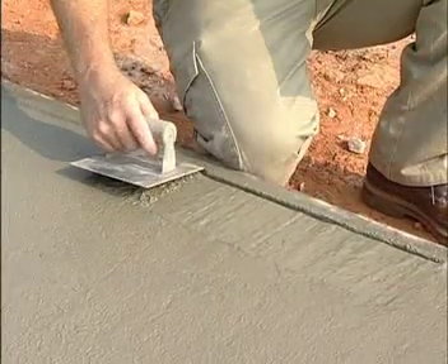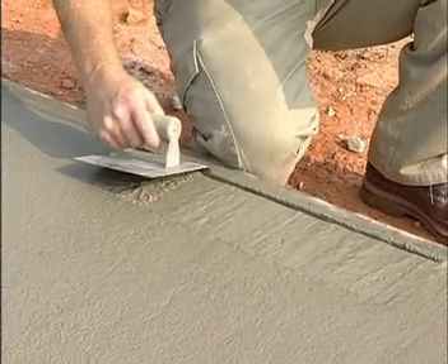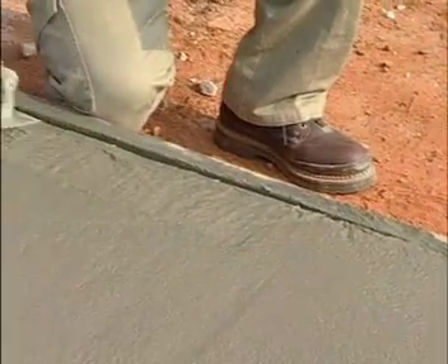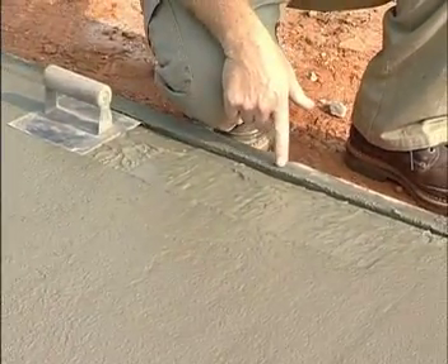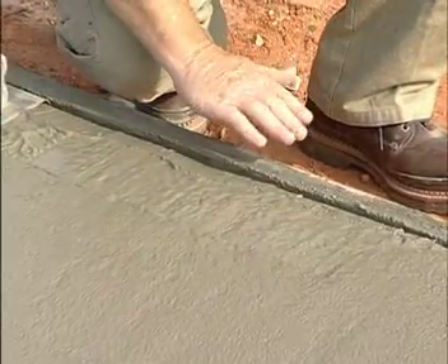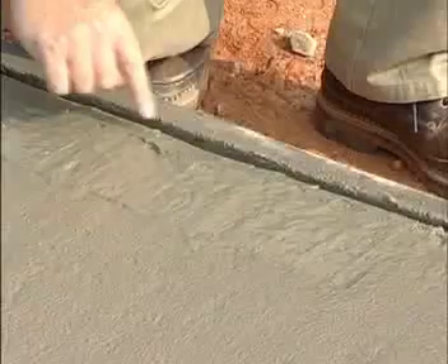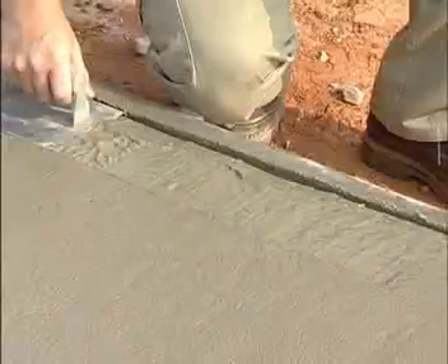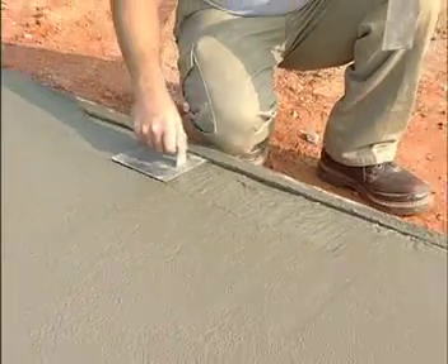As I just talked about, what happens is first-time users inevitably will tilt the tool. The fact that the tool has not been run flat — assuming that we take off our form and pour concrete the next day — this would potentially hold water. So it's important to see this little faint outer line and make sure that the tool is running flat.